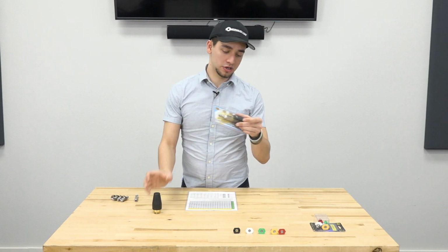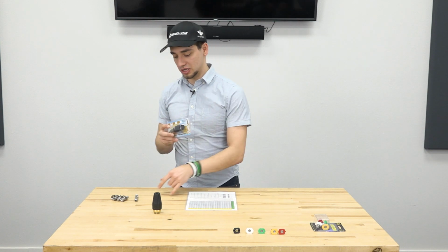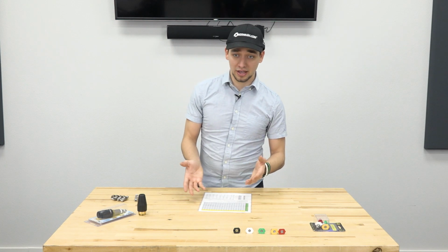This twist nozzle is like using these quick connect tips or the J-Rod setup for 4 different nozzles. You just twist the top and adjust your nozzle size instead of having to switch them in and out. There are a lot more nozzles and nozzle sizes. If you want me to go more into these products, leave a comment down below and we can look at doing that in a future video.